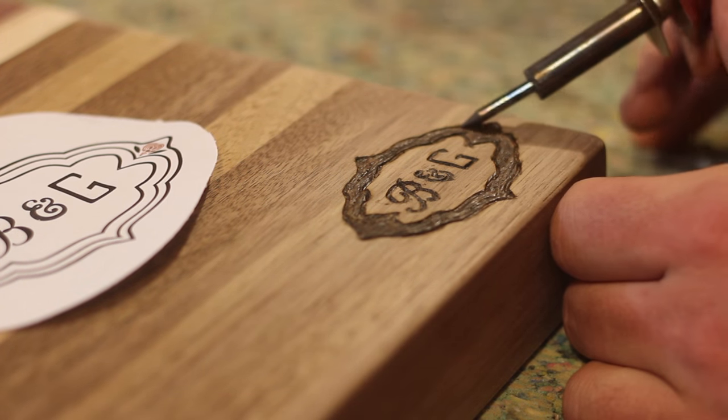Now onto finishing. I like to use General Finishes Salad Bowl Finish on my cutting boards because it actually builds a hard surface, unlike mineral oil which stays porous and open. A lot of people use mineral oil — that's up to you — but I like this because it actually hardens. Check out the Wood Whisperer's channel for more depth on this topic. I saturate the surface and let it soak in, applying multiple coats until the wood stops absorbing. You want the finish in the wood, not on top of it. You can probably get six months of use out of it before needing to reapply.